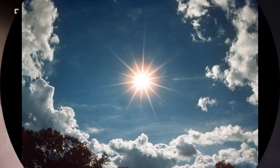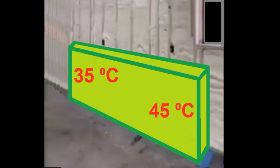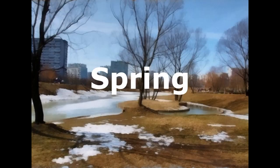The second mode assumes that during sunshine the solar heater fans circulate air only through the box, without connecting to the room, so all the energy from the black wall will end up in the bottles and will heat 1 ton of water to approximately 40 degrees at about 4 o'clock in the afternoon. This mode heats the room only in the evening and at night, without heating during the daytime, and it is applied at the beginning and end of the heating season.